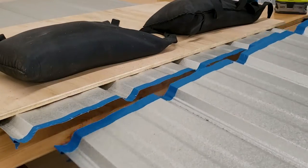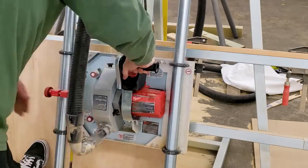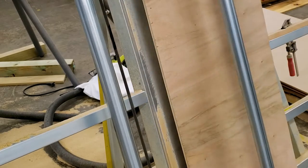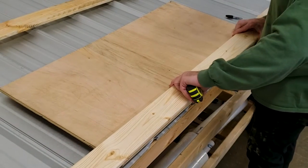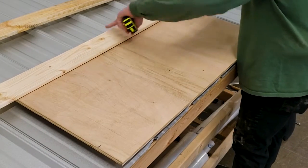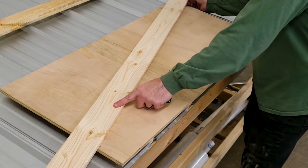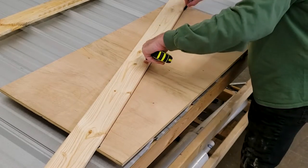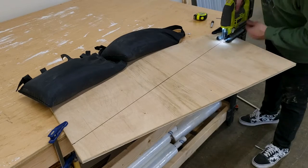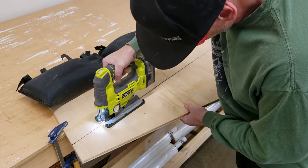We added blue tape to hopefully prevent some shards. We're just cutting both panels in half, and this time we went face down to get more flat contact on the saw — and this was a breeze, super easy. We measured out the width and after one interlocking panel it measures at exactly eight feet. I trimmed the plywood down to 19 inches by 40 inches, then drew a diagonal line to create two identical frame sides and cut them in half.